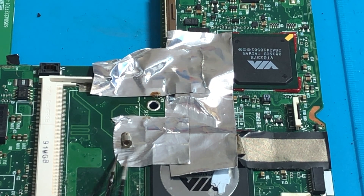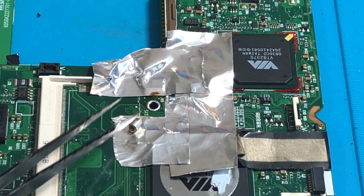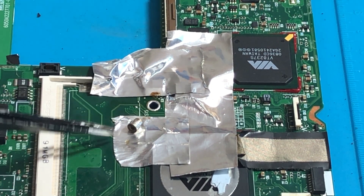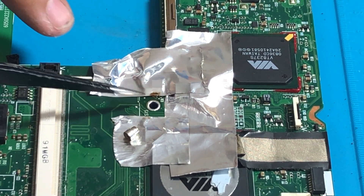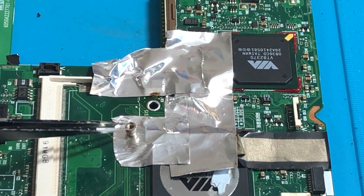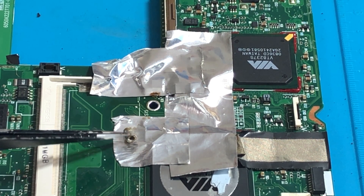So that's how you remove your risers. Now, based on many laptops, when the heat sink riser comes off the solder, people are like, 'Can I put super glue on it?' No. All you need to do is isolate the area and grab your riser. You do not want to put any solder inside the hole, because otherwise the screw is not going to go through.